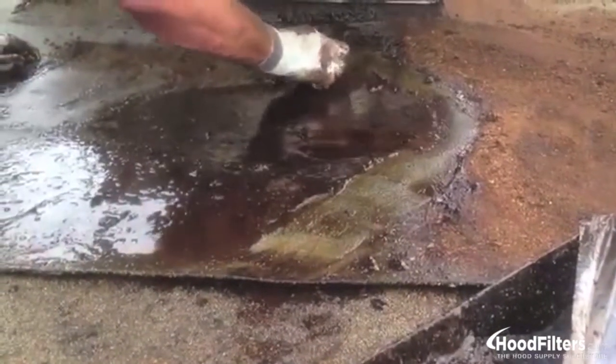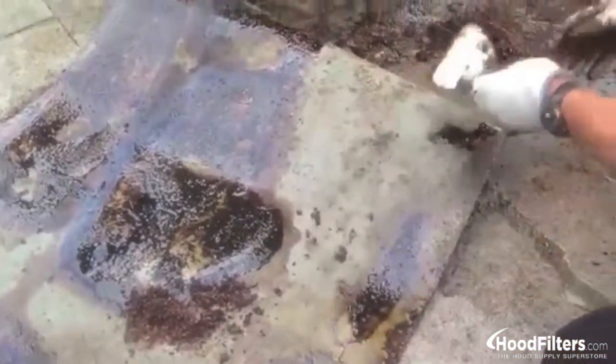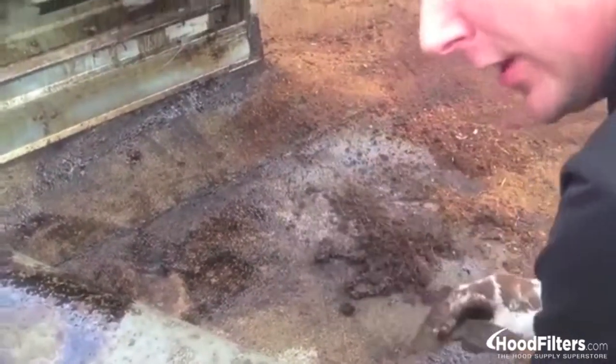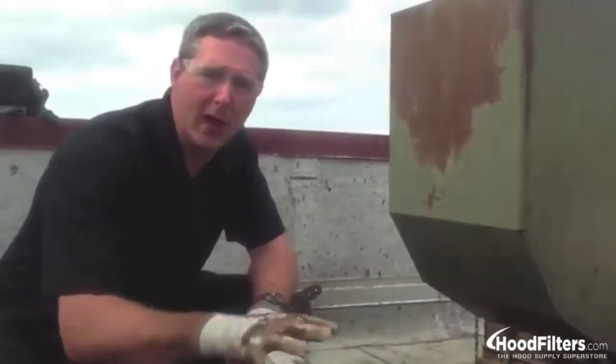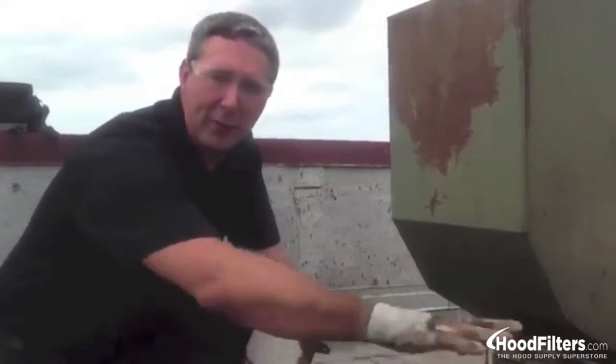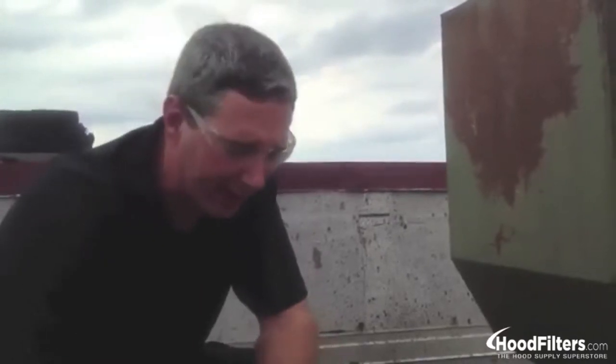Here's a little bit of water. Some of the things that can happen underneath these mats — you can see that oil just gets trapped right underneath there and just annihilates that roof membrane. We're going to go ahead and put the oil absorbent down underneath this and dry all this stuff out too. So we've finished applying our oil absorbent and scraped up whatever grease the roof would give up without getting into the bed of it or pushing into the membrane. We've left about an eighth-inch layer of oil absorbent across the whole surface. For this cleanup we used about three pounds of oil absorbent — you can see that's a pretty substantial stain. We're going to dispose of the old grease containment system and bag it up — there's no use making any more messes than you need to.